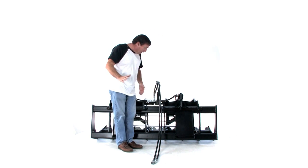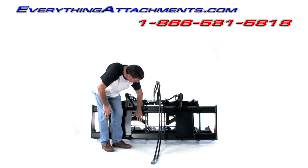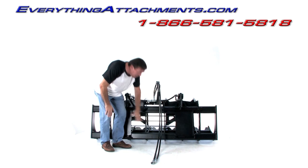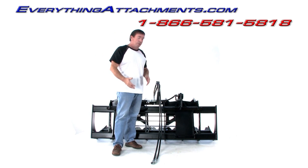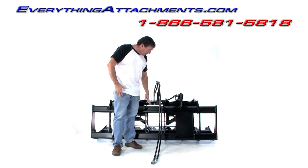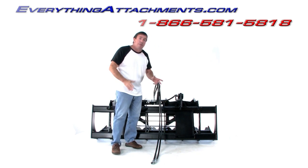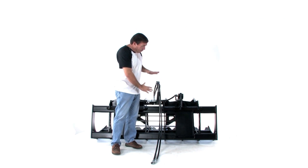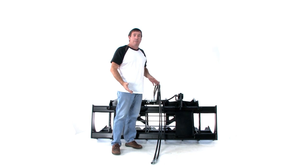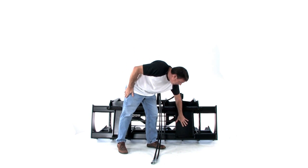But we've added a lot of things to this grapple. We've added this to all of our grapples, but this is the first one we've shown with the new grating in here behind it, to keep large limbs and stuff from going into the grill of your tractor and messing with your hoses. We didn't want to make it any finer than this because it's going to clog up and be hard to see through. So we figure that's a good medium for you to still be able to see through and give you some protection. It does have the full plates behind it here.